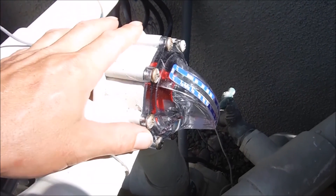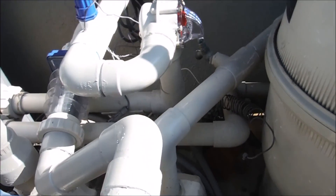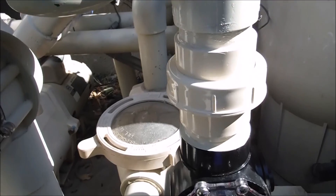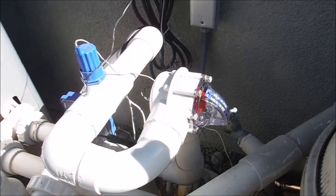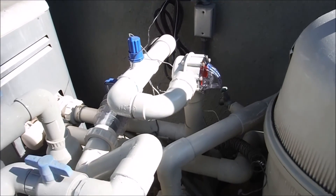This pool has the FlowViz retrofit kit installed here, and I also plumbed in a complete FlowViz a little further down the return line. So it's not a major factor where you actually put the FlowViz. I'll show you that both are reading 60 gallons per minute.